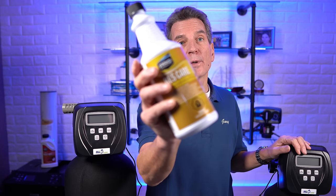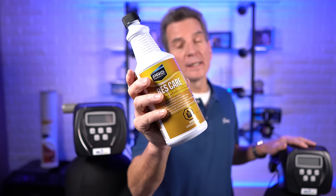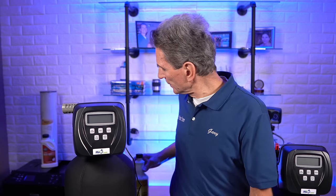The beauty of a sediment filter is there's no backwash involved, you don't need a lot of water, and it's super easy to winterize at the end of the season. The next cheapest way to remove iron is something you may already have — a water softener. A water softener removes iron, typically up to about 0.5 parts per million with no problem. If you start getting higher than that, you need to use a product like ResCare, which cleans the media inside because iron will foul the media inside the water softener.